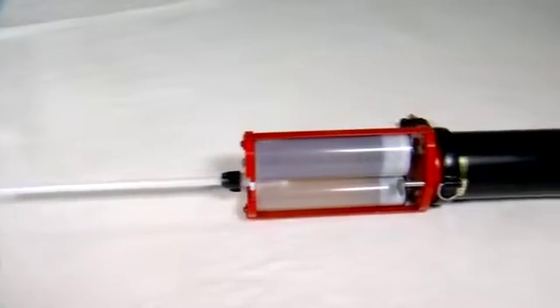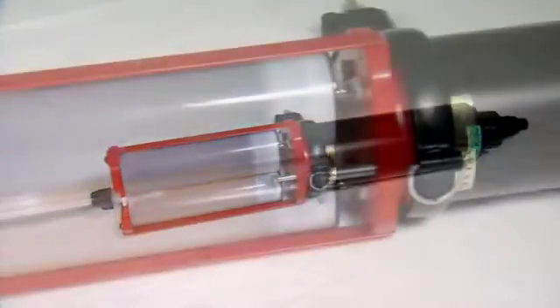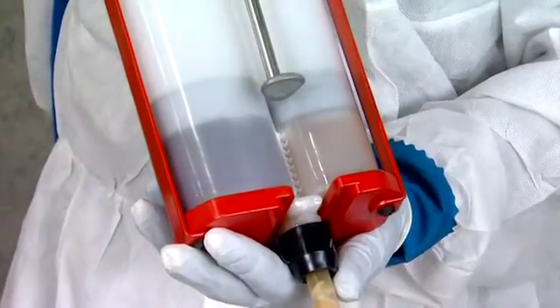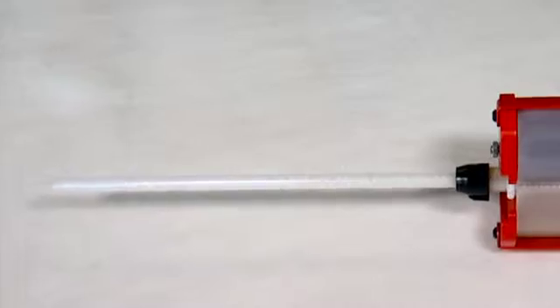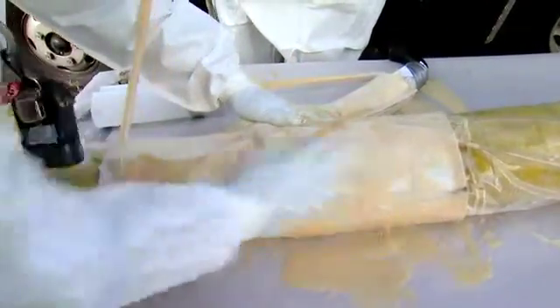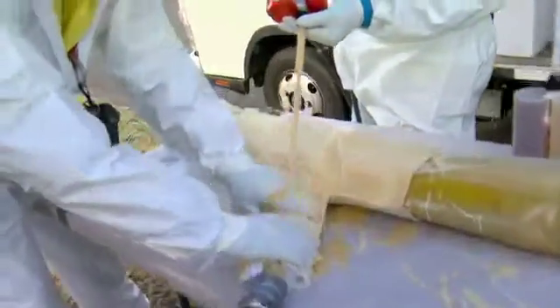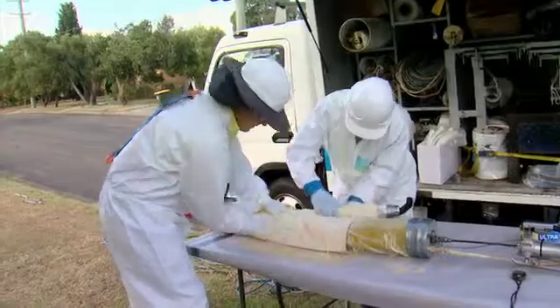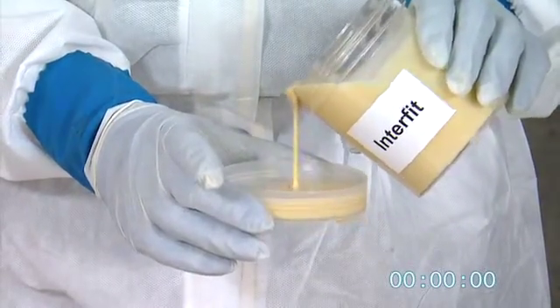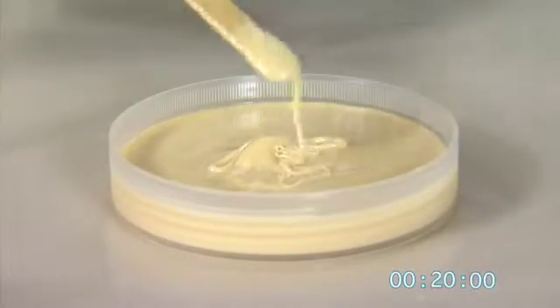The unique Interfit resin is a very important feature of the system. The silicate resin is pre-packaged in cartridges and dispensed via a static mixer, thereby ensuring fast and effective mixing and that the correct quantity of resin is used in each installation. The resin itself is unique in that it has a relatively long pot life or working time of 20 minutes, yet fully cures in a further 30 minutes.